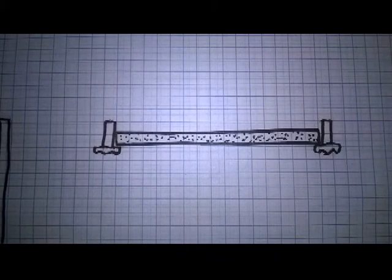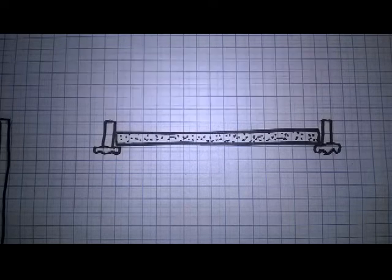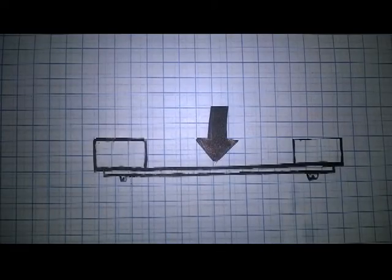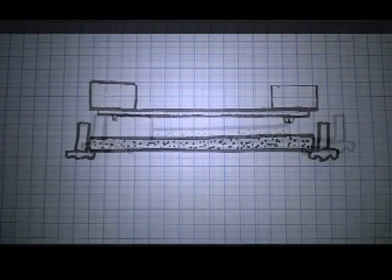Naturally, the distance between the profiles should be enough for the polystyrene sheets to rest loosely on the molding and fitting neatly in place. Once a piece is in place, a short wooden molding with small pieces of cross beam material is used to cover the joints between polystyrene sheets and to provide additional support so the frames will not sag. Keep working until you reach the end of the room, where smaller polystyrene pieces are used to suit the available space. That completes the false ceiling.